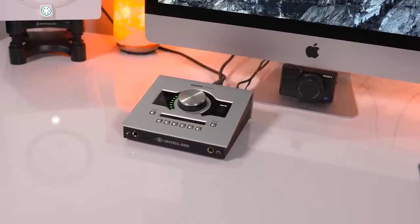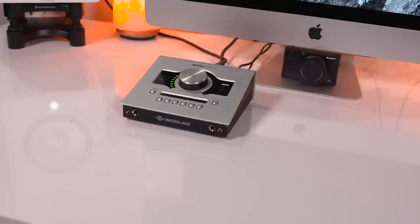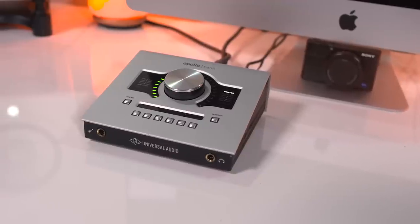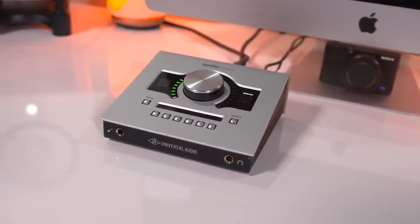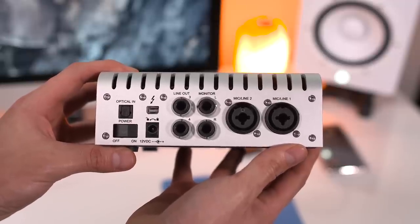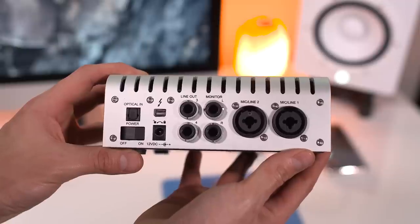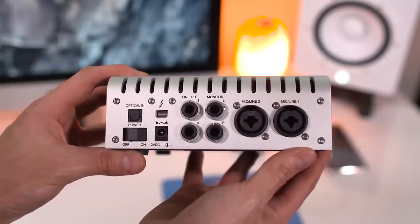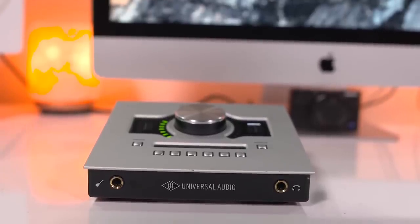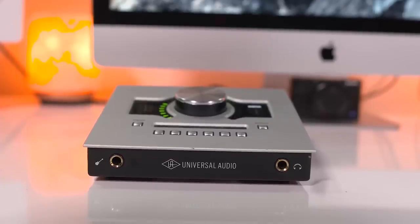We are closing out today's list with one of my favorite pieces of tech of 2014, and that is the Apollo Twin by Universal Audio. If you're looking for quality, this is hands down the best interface under a grand you can get for Mac. It features 24-bit, 192 kilohertz audio, it's Thunderbolt equipped so you get a PCI Express connection. It has two premium super low noise preamps, and it's multi-function so you can use either mic or line. You also get two line outs, a high Z input for instruments like guitar and bass, and a headphone output. Aesthetically and functionally this thing is top-notch, and it also sounds damn good.